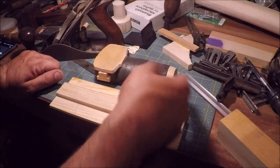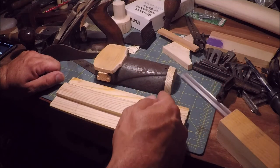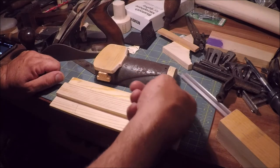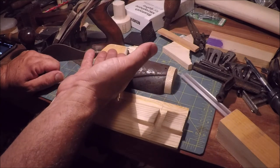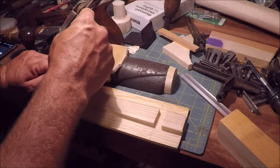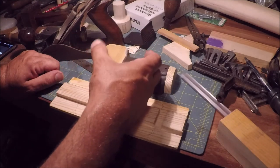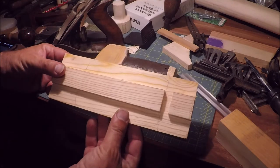I made this extra long - it doesn't need to be that long, just about an eighth of an inch would be plenty. The gating system is going to come in this way, so when the metal gets poured it'll come in through the side, fill up this cavity, ultimately coming up to this level. Then we put what's called a riser in here that'll allow excess metal to come up, and as everything cools and shrinks it'll pull metal from that reservoir so the part does not shrivel up and get distortion problems.